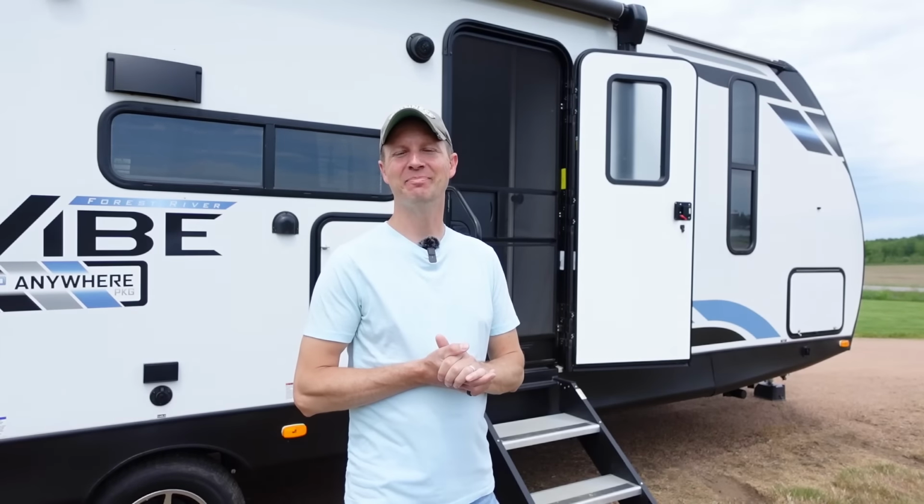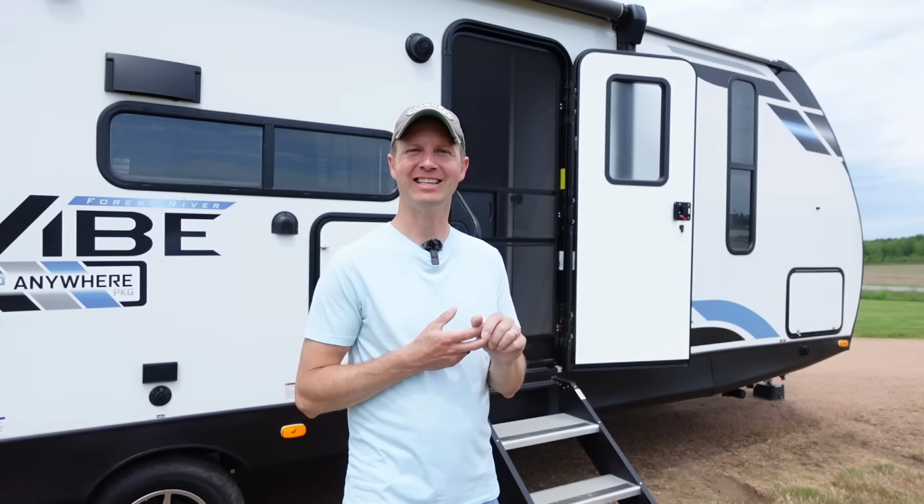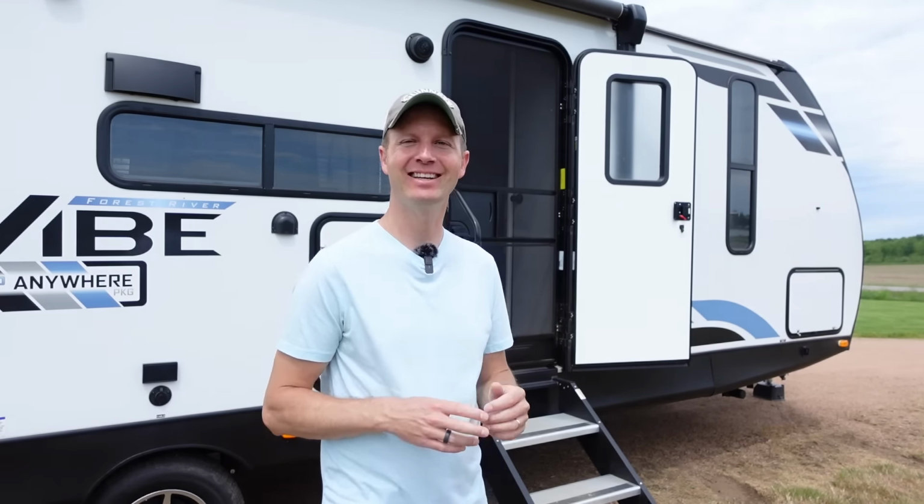So for the first test, you're gonna see roughly a day and a half on this 100 amp hour battery with the 12 volt fridge that I have and two LED lights running, which is pretty impressive. Now I'm going to reconnect the solar panel, which is a 180 watt solar panel, and we'll see how long the system can run with that 100 amp hour lithium battery. All right, it has been over 1 week now since reattaching the solar panels, running my 12 volt refrigerator along with two LED lights. Let's take a look at what's going on inside.